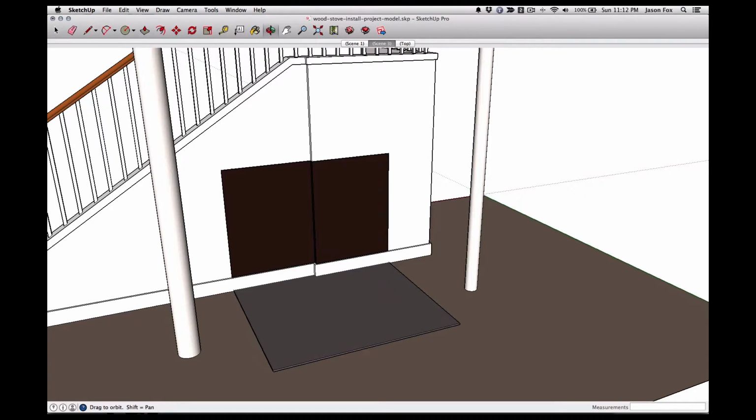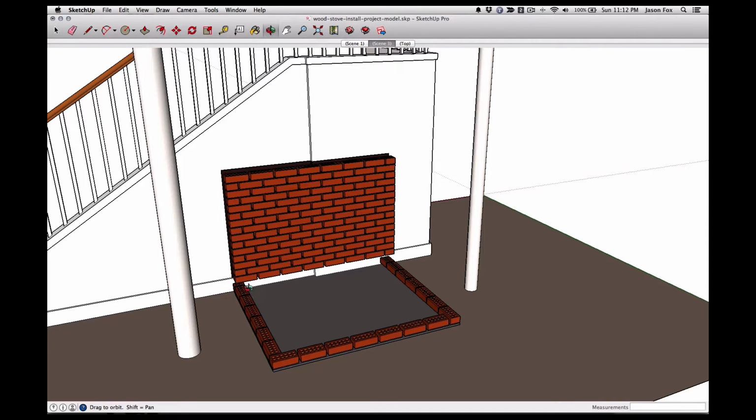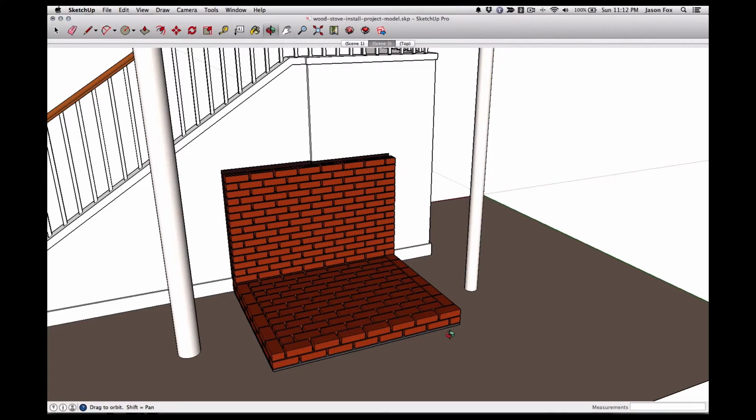So we're going to start with this brick surround here and fill that in. Actually, I don't show the fill in because I didn't want to make all the shapes, but it's going to use this brick with holes in it. And then we will fill that in and start the brick wall in the back, which will be sitting on a lower level of bricks here, and then fill in the brick top. So that'll be all the masonry, and the wall is going to be affixed to the drywall every so often with these little wall anchors that sandwich between the bricks and the mortar. So let's get to it.